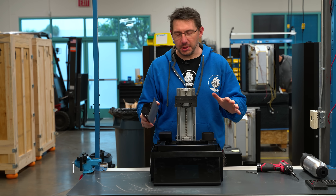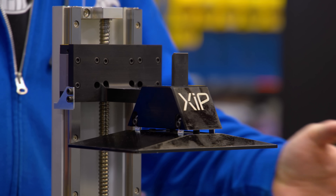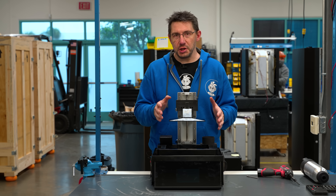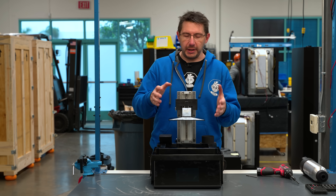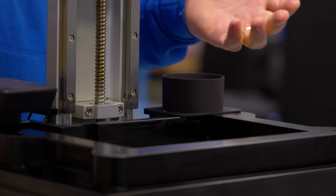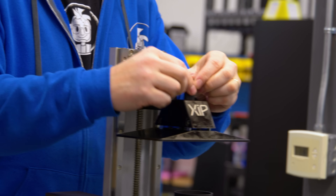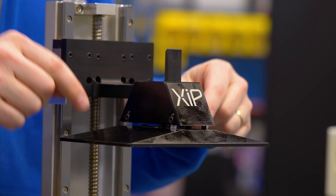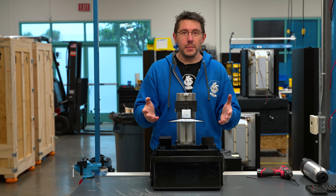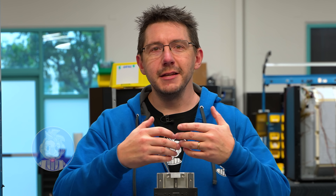One thing to mention about this question is the way the build plate attaches to the arm. The mechanism or latch is down — you can slide this on and then a quick flip up and it locks into place. With consumer-based resin 3D printing, the build plate is usually at the end of a ball head, and you bring the plate down to the surface and tighten it up. Over time, just from printing, it can shift a little. This latch mechanism ensures it won't move and will retain that factory level setting. The goal for Nexa 3D is to have very minimal interactions with the machine as far as leveling — leveling from the factory should translate to many happy prints.